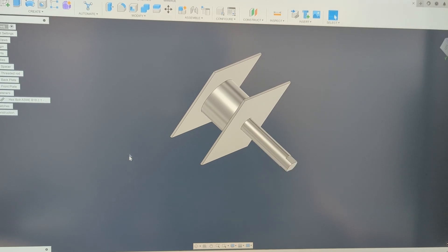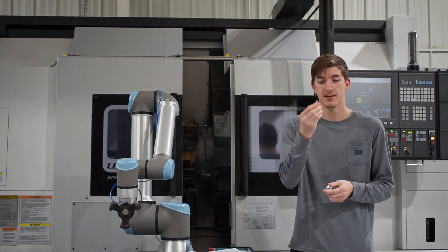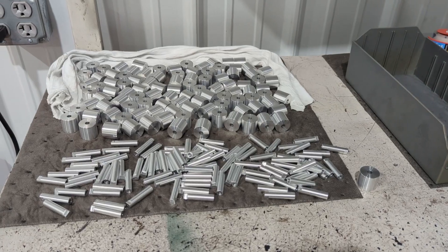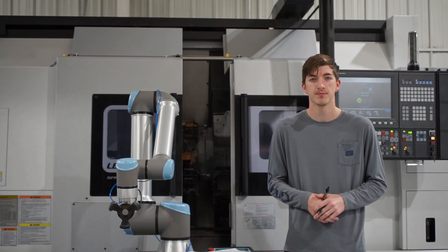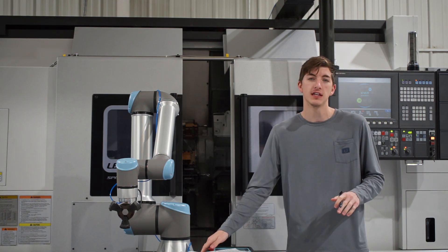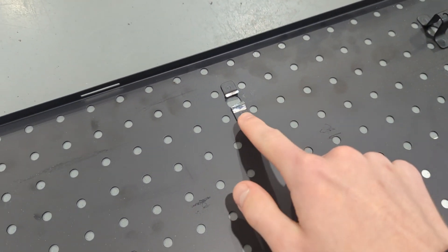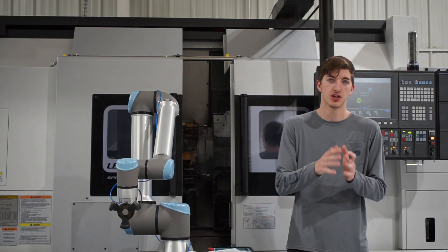The pin screws on, which tightens the two sheets together, making it more rigid than just the sheet by itself, and I would have a known datum. I programmed and made about 100 of each of these components — one pin board takes about 40, but I made extras in case I want to build another one. Before putting everything together, I had to flip one of the peg tables over and grind off the tabs for the wall mount so the two boards could mesh together really well.